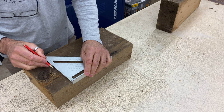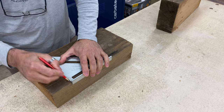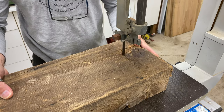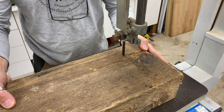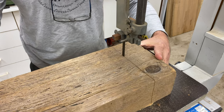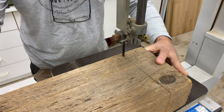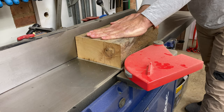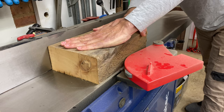I wasn't concerned about how it would look all glued together because at this stage of the build my intention was to paint the head silver or aluminium, but as you'll see I changed my mind about that. I trimmed them up with the bandsaw first and then milled them down further, first on the jointer and then on the table saw, to get some nice clean pieces.